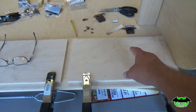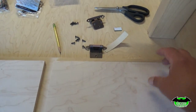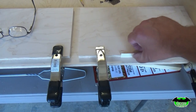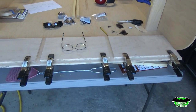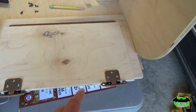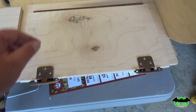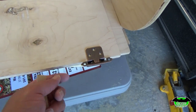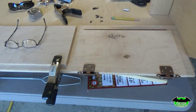One at a time, I'm going to take the clamps off. I've got some self-closing hinges that we'll be using. We'll mount those on the back side here, and then we'll get them fastened onto the face, make sure everything looks good, and then we'll remove them. I've also got some edge banding that I'm going to be putting on the doors. So, I'll turn the cabinet face over — this is the bottom piece here. I've got my hinges set, about an inch and a half away from the edge to the edge of the hinge. I'll be using a piece of this banding as a spacer so when I get ready to tap my holes and get the banding on, it's going to fit right. I'm going to go ahead and fasten all these on and set them in place, and one by one we'll get them fastened on the front.